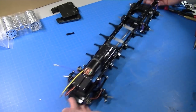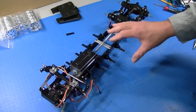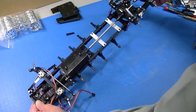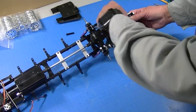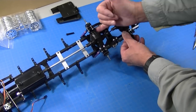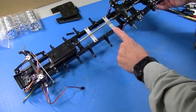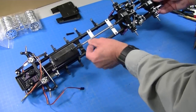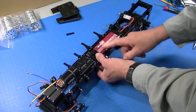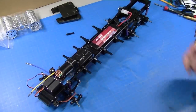You can see I've got my chassis assembled with the gearbox and rear ends in. I have other videos that show how all this stuff goes in. A biggie on the rear ends is to make sure you get the transmission bumps the opposite direction and the little bump stops go towards the frame. We're completely stock except for how I did these cross members, and this all clears just fine. I checked and with a battery in here, the drive shaft clears just fine no matter where the suspension is. So now we're ready to start building the rest of the truck.